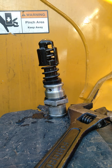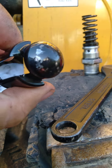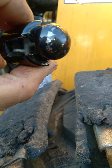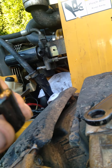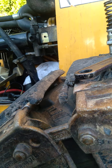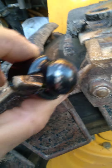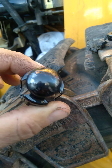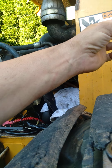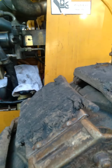That will come out — you might have to stick your finger up in there because this one is all marred up. It was kind of wedged in there, but I think I found the issue finally. I'm going to try to use some emery cloth and polish that out, or some jeweler's rouge on a mop wheel, and hopefully put this thing back together — because the manifold itself is $500 from Deere and I don't have $500 for this right now. I'm trying to make money.